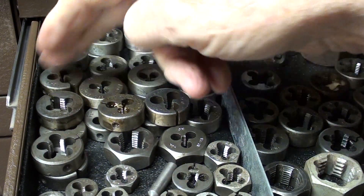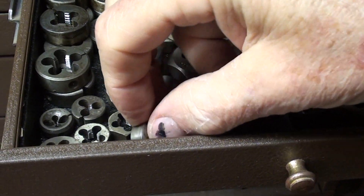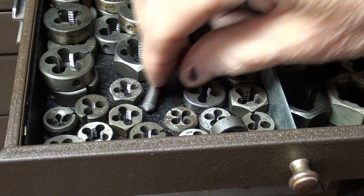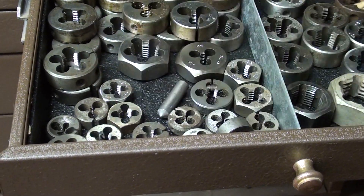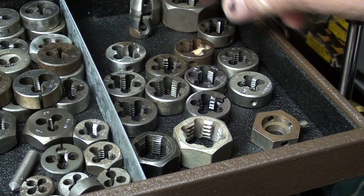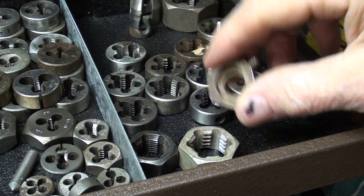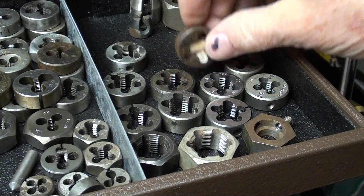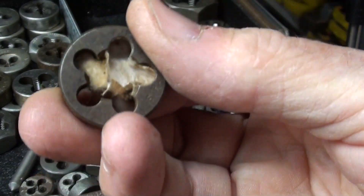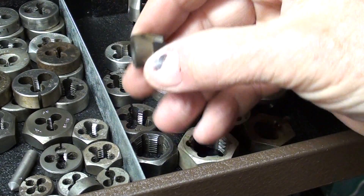In this drawer, some of my dies — I call them button dies. These are all the one-inch size, some of them are hex and some quite small ones. I think these all came from West Glock's and I've never used one of them. There's a diamond in the rough. These are primarily re-threading dies on that side, and an adapter. That one's not been used recently — there's a cobweb in there, and even the cobweb is ancient. These were called acorn dies.